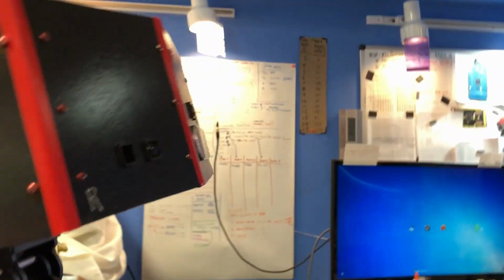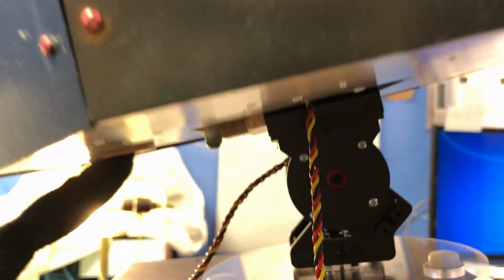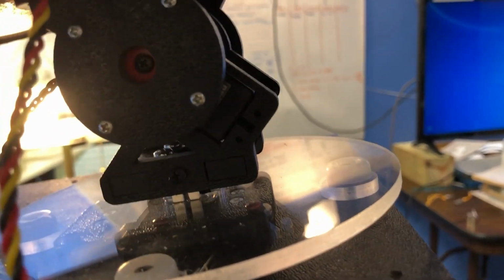And inside the head, they basically connect to these infrared distance sensors. So when the head swings around, I can look around the room with those distance sensors and see what's in front of the robot and on either side, and I can turn the head and look 90 degrees, backwards, whatever. The head is mounted on a pan tilt swivel mechanism. I had to recently add this plexiglass disc and those frictionless guides to keep the head from bouncing around so much as it drives.